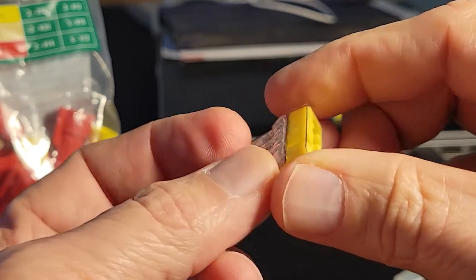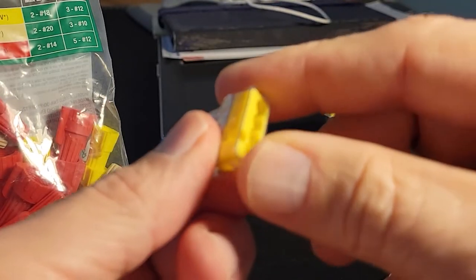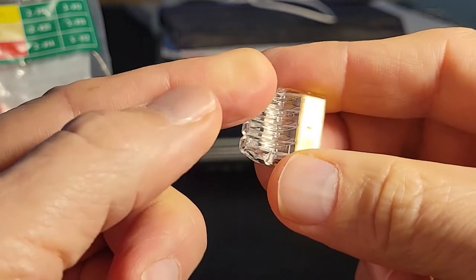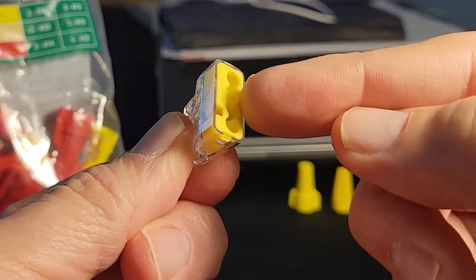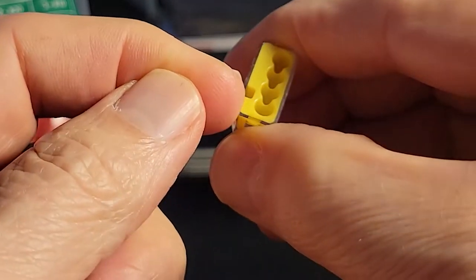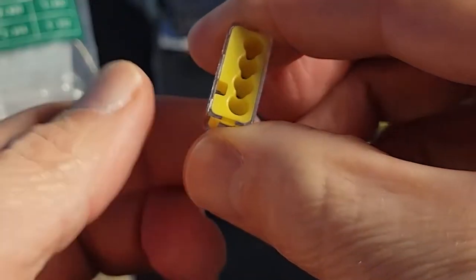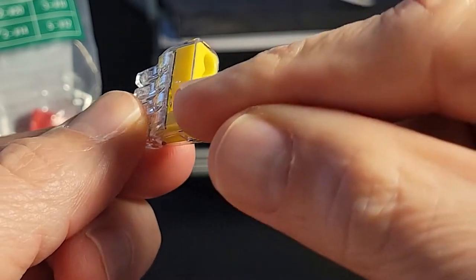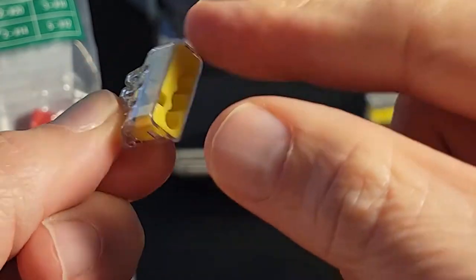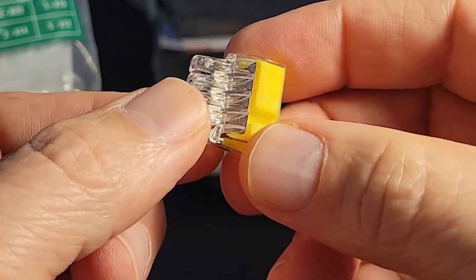These are nice. They can take up less space. They tend to be fast because you just cut the wire, push it in, and you're done. And the bus handles spreading the electrical connection to any other wires you push in there. And this little knockout there, that allows you to test this connection. So you can actually put a probe in there and get a reading on the electrical or ohms or continuity that you want to measure.